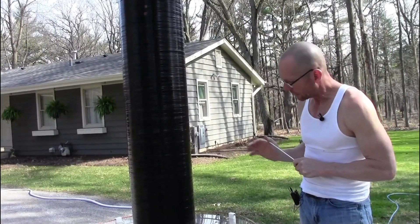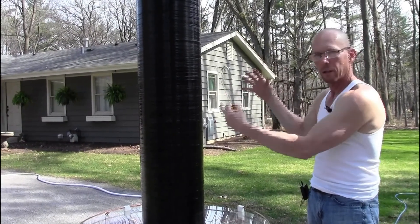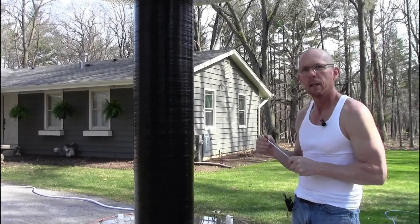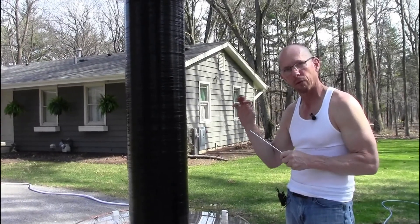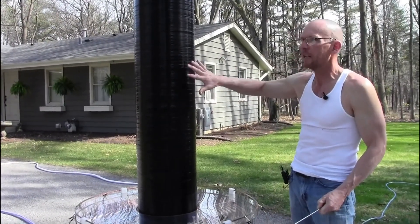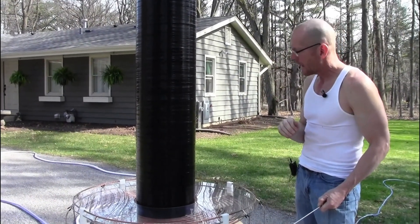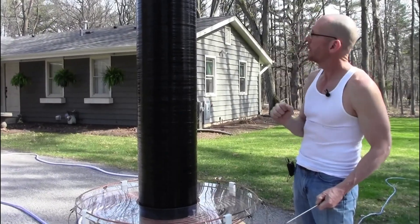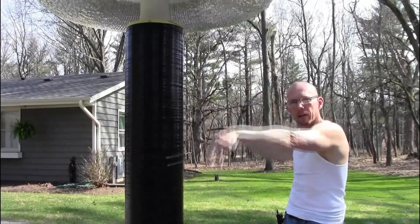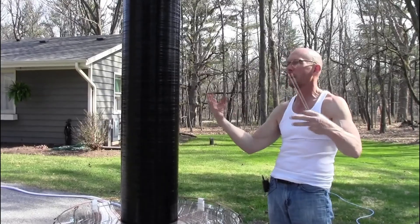I did want to do 20-plus coats of polyurethane varnish for a beautiful gold secondary form, but found that at the power levels I was delivering, any small miscalculation in phasing or frequency balance caused bad things to happen. The only way to contain that type of electrical energy was to wrap the whole thing heavily in thick electrical tape. It may not be as aesthetically pleasing, but when you run this thing at night you've got this big black form with blue ultraviolet spark coming down it — and it actually looks very good.